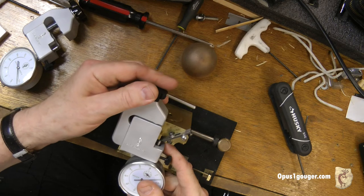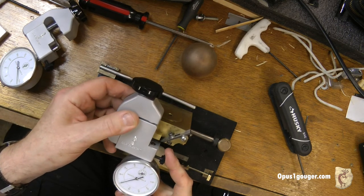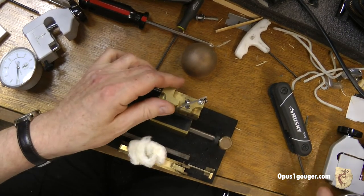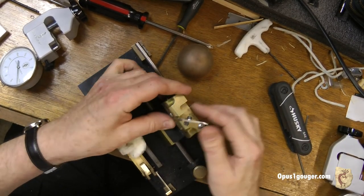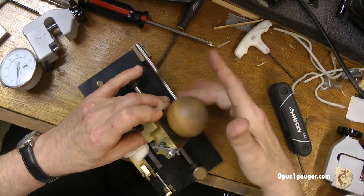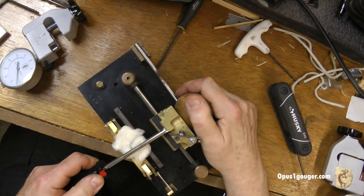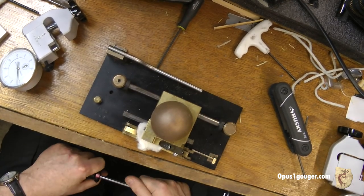When you remove this, loosen it a little bit, take your hand and pull the plunger down, push it forward, and once you are off the carriage then you're safe. When you finish, take your screw back through here and spin the ball back on, then snug it down with your screwdriver — and you're in business. That is pretty much how you use the blade exposure dial indicator.